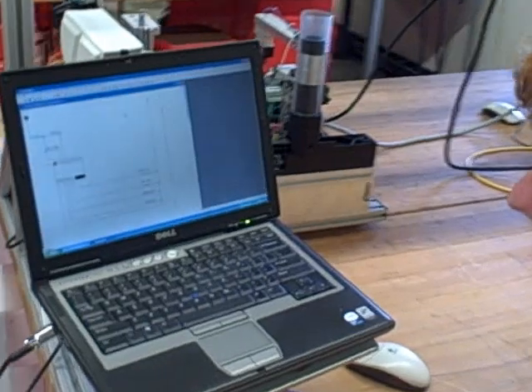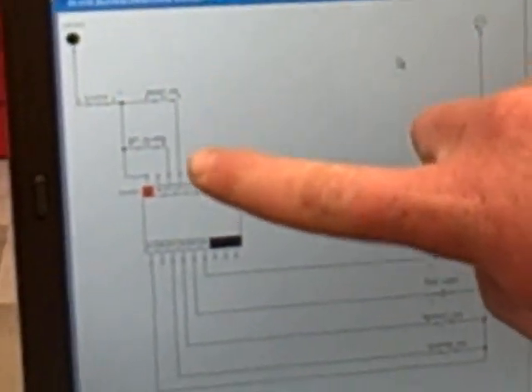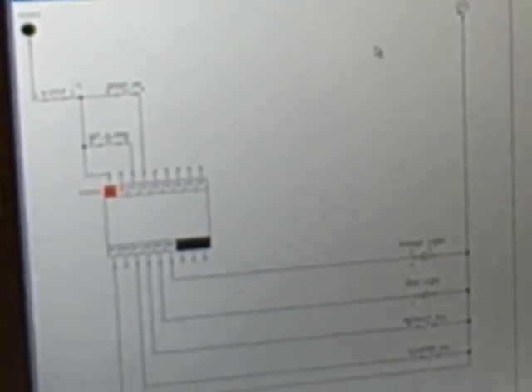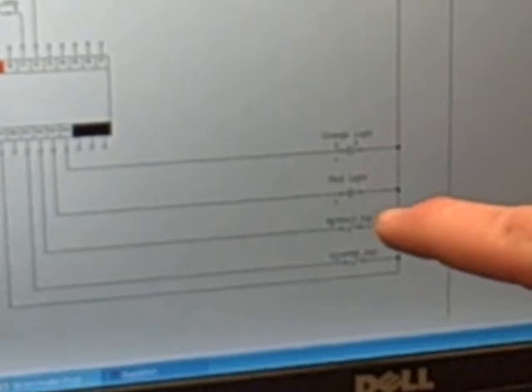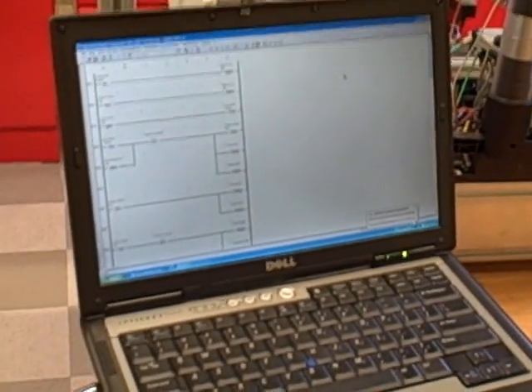This is our electrical schematic of the bed. Right here is the e-stop, and then that sends power to everything like the reset push button and the alarm and the PLC. Over here on the output side we got an orange light, a red light, the retract solenoid, and the starter solenoid. Then when we go in here to the ladder program, it's just all my lines of ladder logic. There's 19 different ones, and I did this in the EasySoft program.